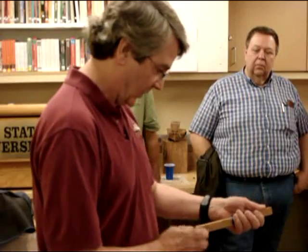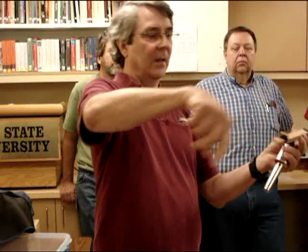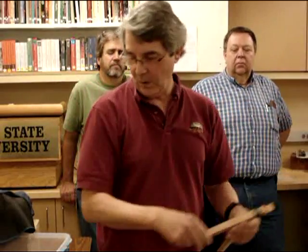This guy is really handy — it's actually from furniture stuff, usually used to check square on drawers. I found that for my stools it makes it really easy to splay the legs and measure how long my stretchers need to be. It would work for Windsor chairs also, not just stools. These are Veritas pieces from the Lee Valley catalog — they're a couple of bucks, and you make the sticks yourself however long you want.